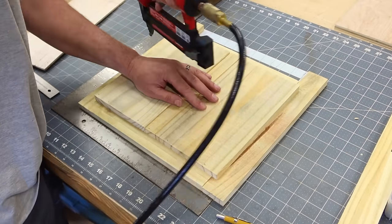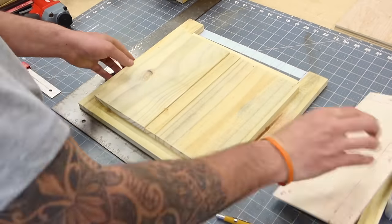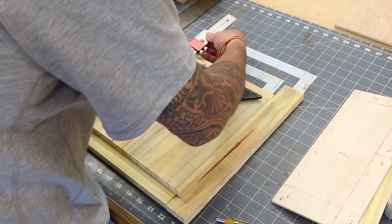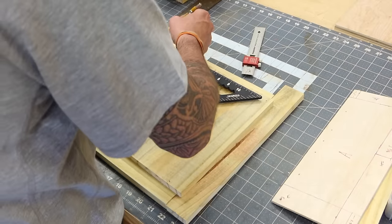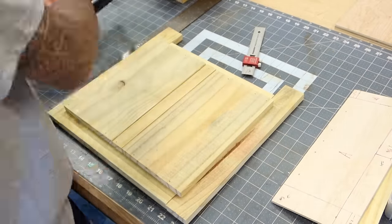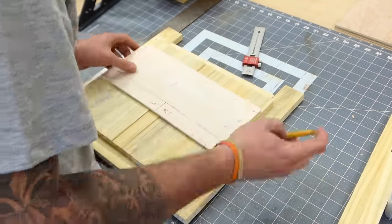Using two parts labeled back wall and one labeled middle wall, we put those into place. The outer wall is an inch and three eighths from the edge, and we want all wall parts one inch from the top — I've put both of those on my jig. For assembly purposes, I'm using one inch brad nails just to hold everything in place while I'm working with it. You can also use exterior wood glue if you'd like, but this will ultimately be held together with one inch deck screws. Since this will be on the inside of the planter, I'm not too worried about the nails.